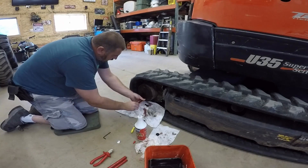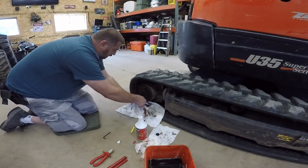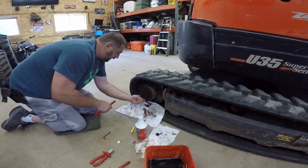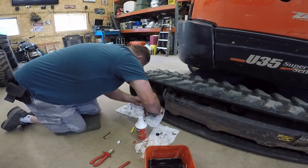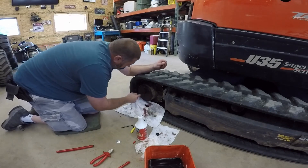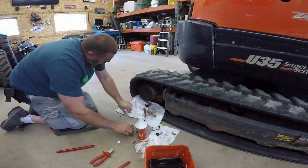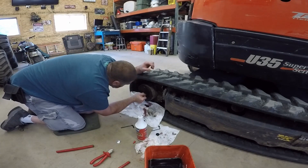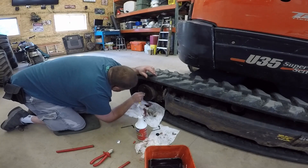Pop off my bottle here, put a little lube on the O-ring. These plugs should be tight — very tight. Take out your oil level plug, set it off to the side. Same thing — clean that out, make it nice and clean.